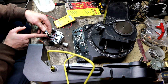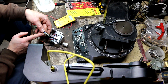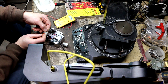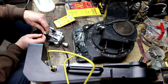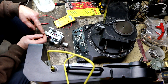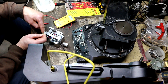The voltage input pin goes right over to a pin on this plug here, and the ground on that IC goes to these two pins. The first two pins are tied together as ground, and the third pin is the VCC or input voltage. Looking at the wiring, the brown wire and the orange wire are ground, and the green wire is the voltage input. What I was getting there was only about five volts, dropping down to two volts when I plugged it into the board.